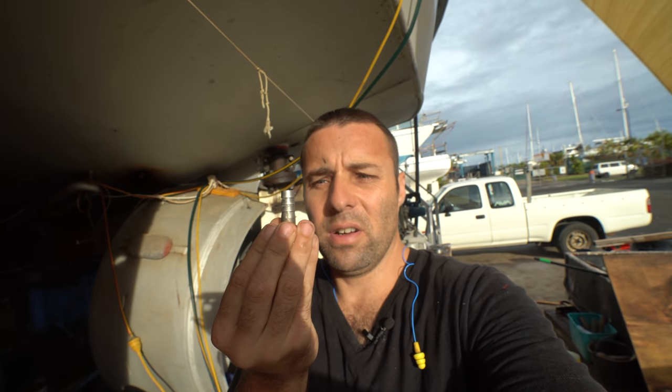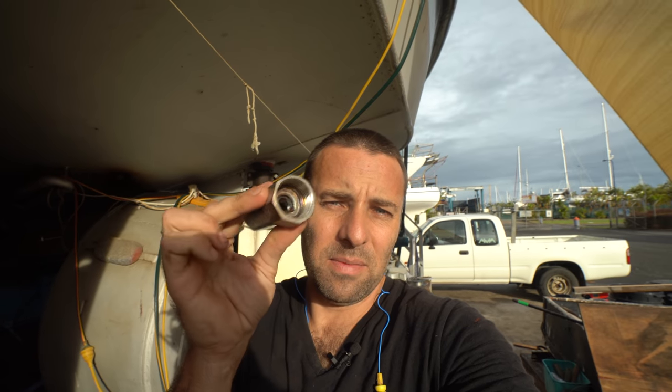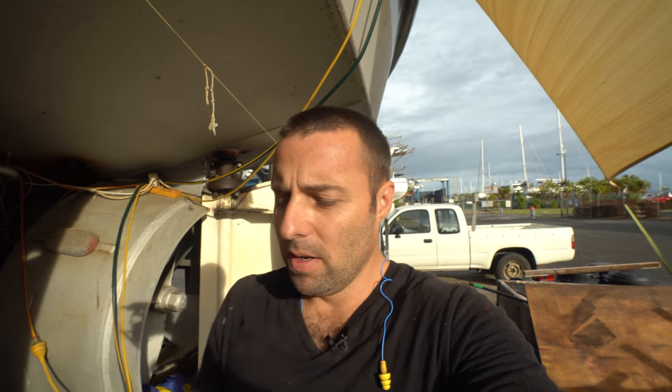This here is a perfectly good hose tail that was on the machine on one side. That's fairly frequent, that sort of stuff going on the machine. And that was the bit that delivers the sand from the red tank down the line towards the gun. What I've done, it used to weld onto the end of this little piece here, but I've welded this great big fitting on so that every time it chews one out, we can just swap it over and screw it in. So more fixable, basically. I haven't stopped the problem, but I've made it easy to deal with the problem.